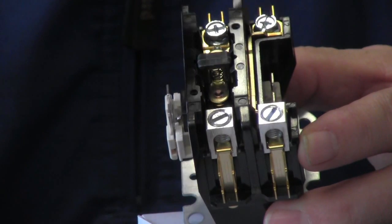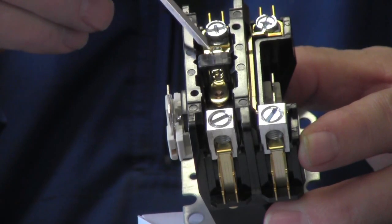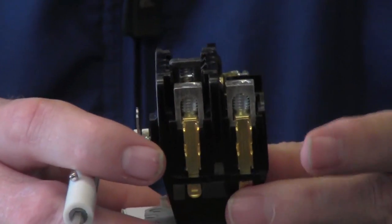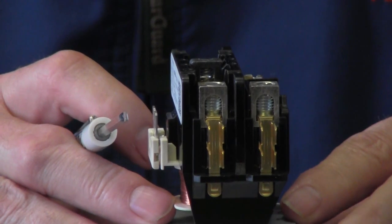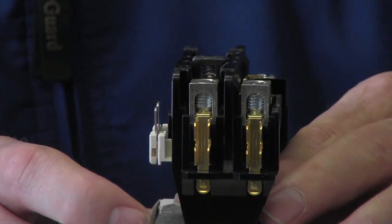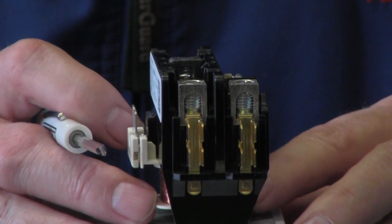It's already going to be powered up to here since this is a single pole contactor. What they mean by poles is how many contacts it's got — this has just got one set of contacts in it. Later on in the video we will go outside and I'll show you installation of this contactor. Let's go outside and get started.